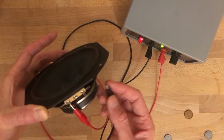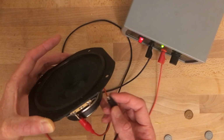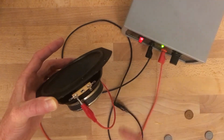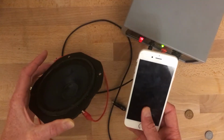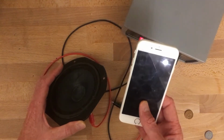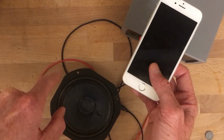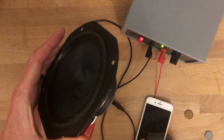And so how do you actually get these vibrations? Because obviously no one's going to sit here and do that really, really fast. Well, you need a very smart power supply that can send the current forward and then backwards, forwards, backwards, thousands of times per second. And what could do that? Well, your phone is a very smart power supply that sends that sort of alternating signal when it is connected to a music app. And that music app will tell your headphone wire to send a signal according to the song that you're listening to in such a way that it tells the speaker exactly how to vibrate.